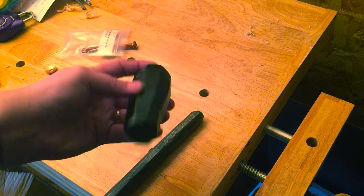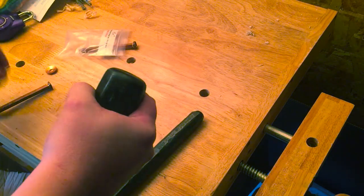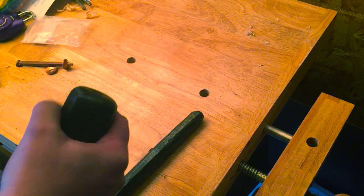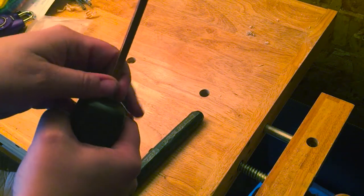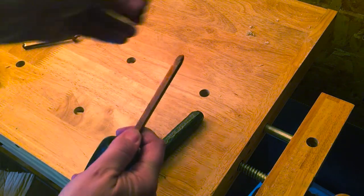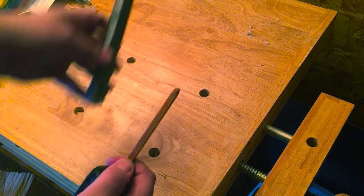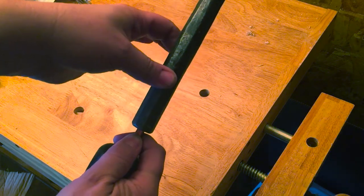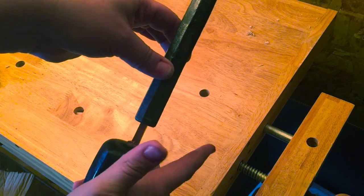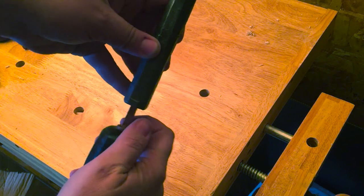You can basically get a nice grip on it. So when they put the hole through the wood, this goes right up on the back, then you put the rivet on and just drop the rivet — this gets hammered on to set the rivet. And that is as far as it goes. If the wood is thinner than that, then they're going to have to cut the rivet first. You cut the rivet off wherever the washer sits, and then boom.